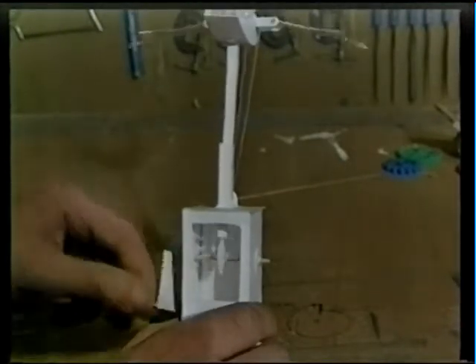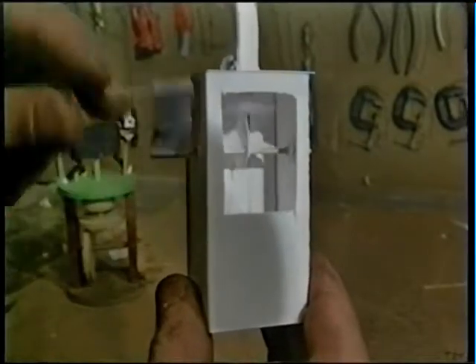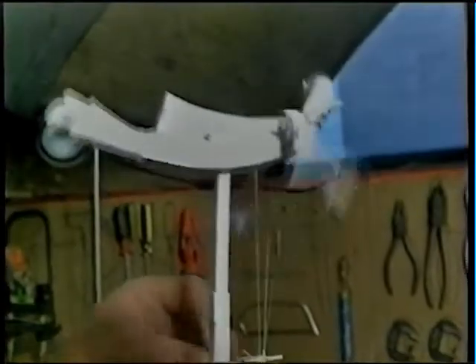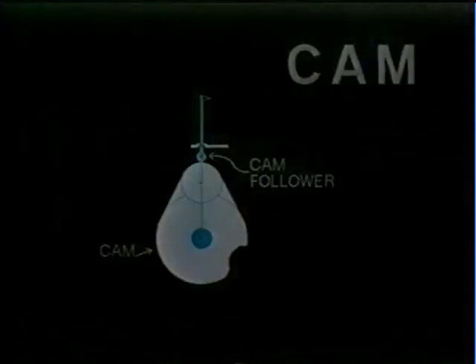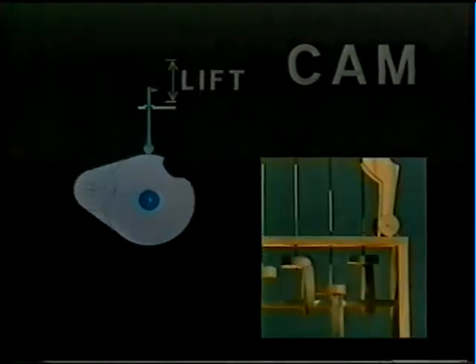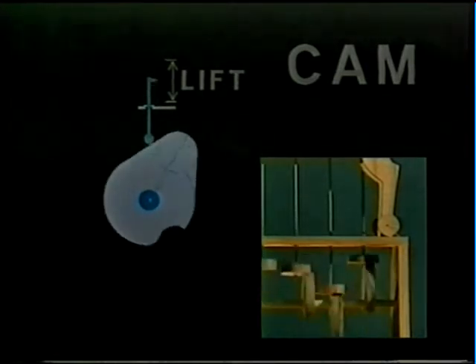This is a prototype for a cutout called the Flying Doctor. Instead of the crank slider that I used in the Flying Pig, this one uses a cam. The cam is a circle of card which is rotating off-center. The most common type of cam rotates against a follower which tracks the shape of the cam's profile. If you try to make a small cam produce large movements, you may find that the friction and leverage on the follower cause it to jam.